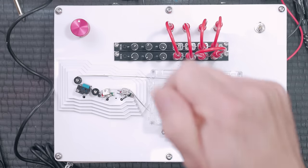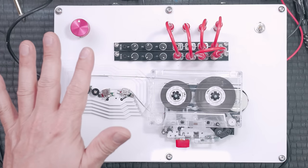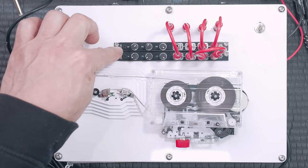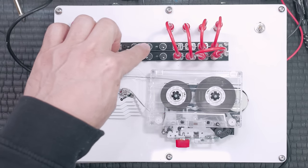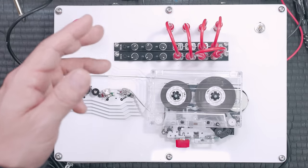And then obviously I have the mixer circuits. So my prototype one was active mixers, and that worked really well. These are passive and they do not work as well because all they're doing is summing up all these voltages and you're getting sort of a weaker signal.